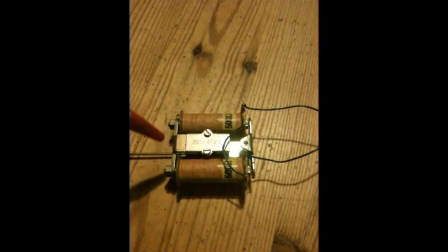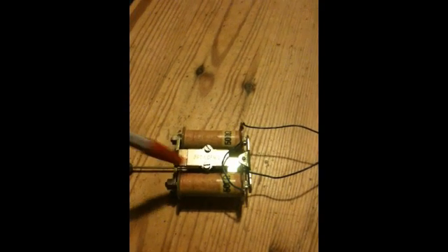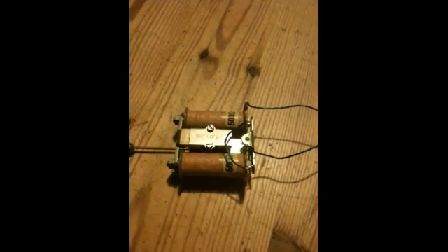Normally these operate on AC current, and if it's just DC current, all that would happen is there'd be one movement and nothing else would happen. So what we've actually got here is two circuits: one is a magnetic circuit, and the second one is the electrical circuit, the current circuit through the coils.